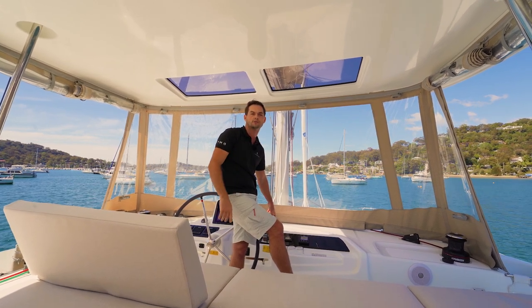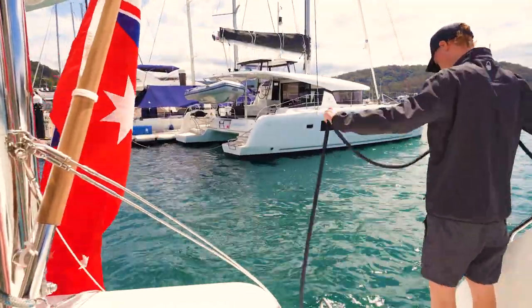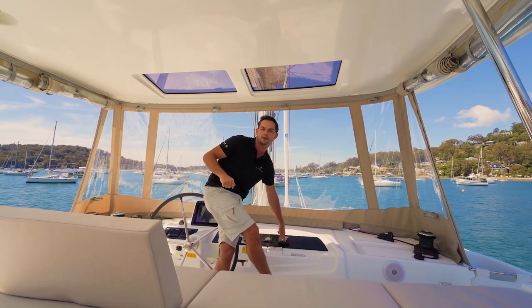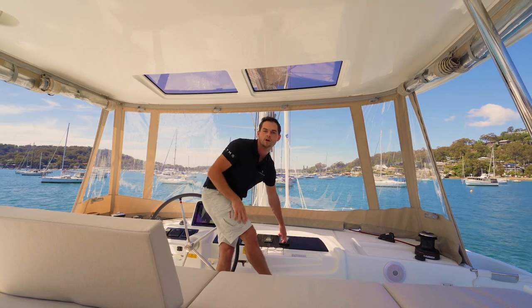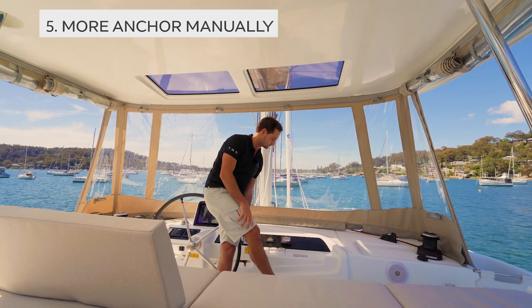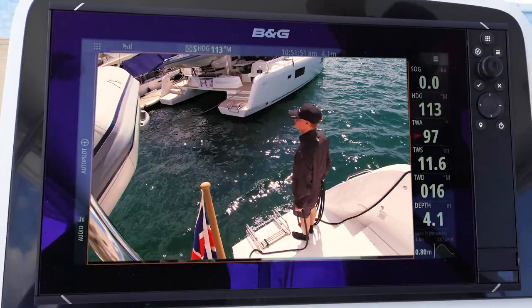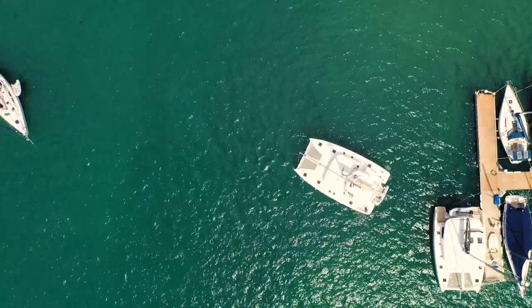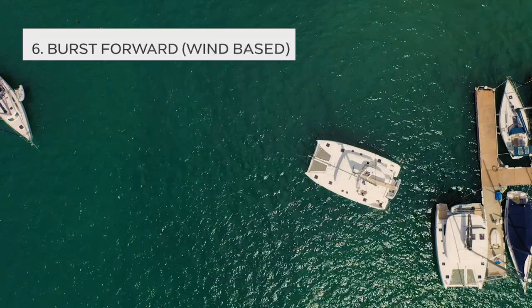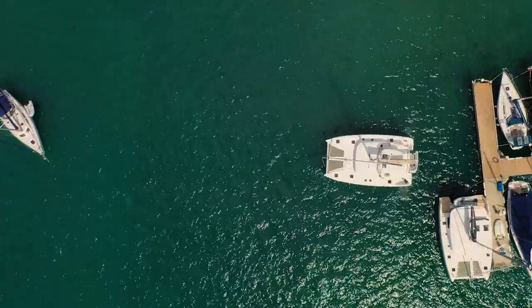I've told Ben to stop — I'm about a boat length off the dock with plenty of chain let out. I've asked Ben to come back to the windward corner of the boat. It's very important he comes to the windward corner because that's the first line I want to get on. As soon as the windward line is on, I can drive on it and hold my position quite nicely on the dock. I'm letting a bit more anchor chain out manually as Ben is no longer at the anchor winch. I've got 40 metres of chain out now. The boat is on about a 45-degree angle to the dock, but as I get close I'll give the starboard engine a burst of forwards to slow me down and turn me in line with the dock.